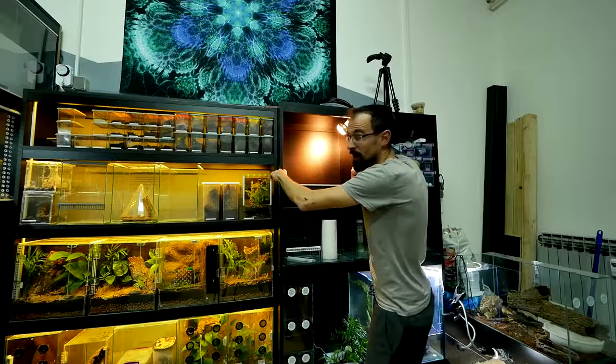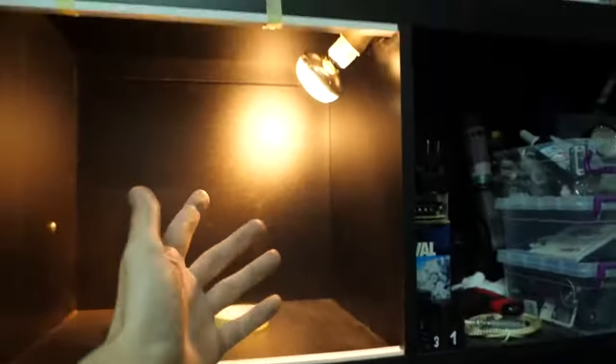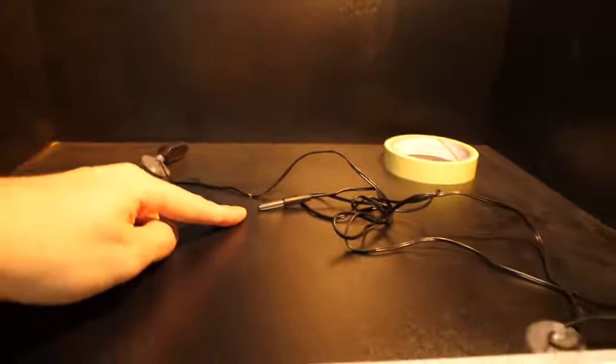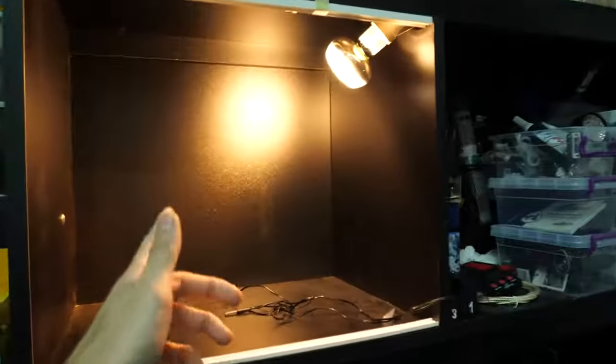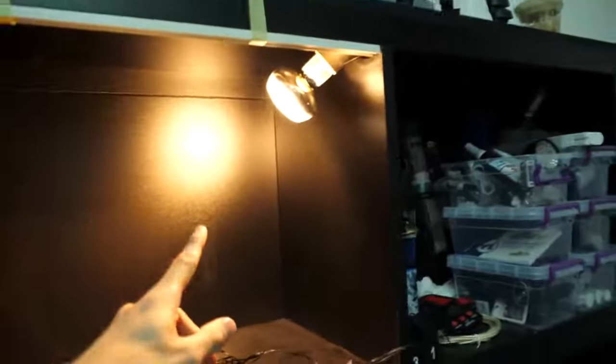Now I will put this in its place. There we go - it is ready. Now all that I need is a piece of glass, but I need to order that first. It will be the same system as this, just a lot smaller. Let me measure the temperature inside. This part goes here and I'll leave that in the middle. It seems it stopped at 28 degrees, but I assume that once I put the glass the temperature will be even higher. So I will probably end up putting a lower wattage light bulb - this is 75 watts but I can easily put 50 or even less, depending on the situation. If needed I can also add a thermostat to regulate the temperature.